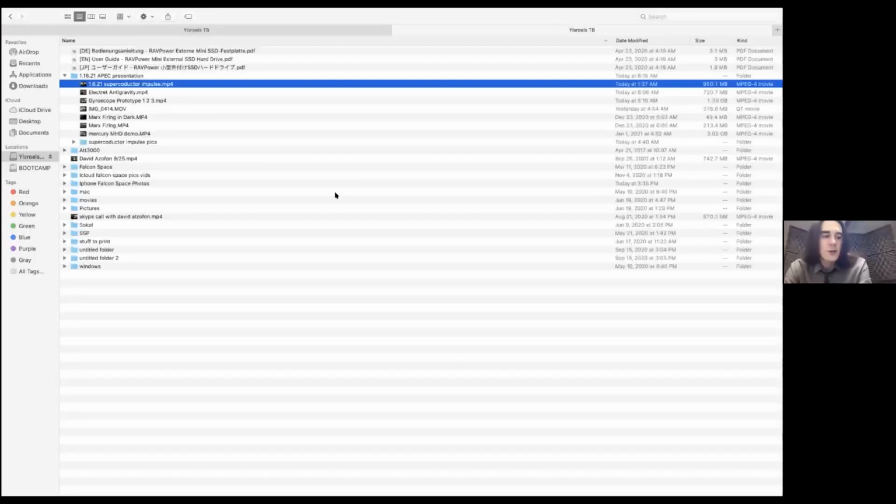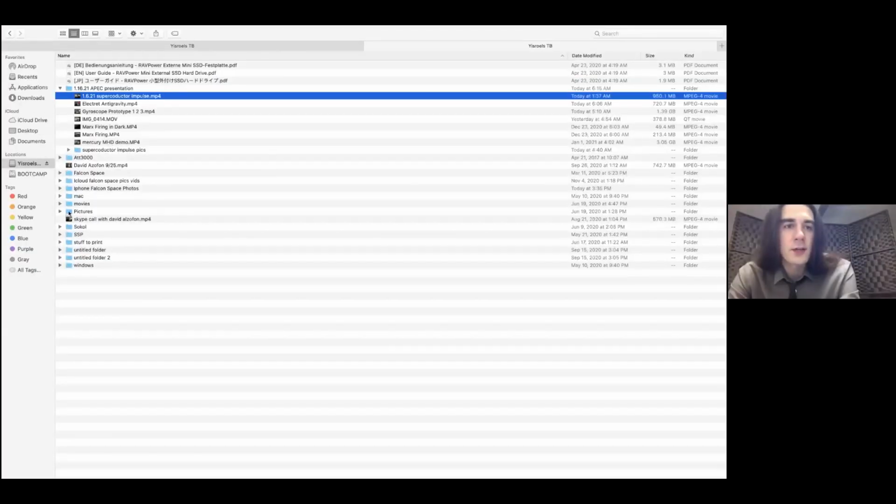It's got to be under significant clamping pressure, which is one of the things we'll have to change next time. That whole stack, just because of the current flowing through it, would tear the metallized plating right off the surface of the superconductor. So there does have to be enough downward pressure to hold that block together. And also the container was pretty terrible, leaking liquid nitrogen.